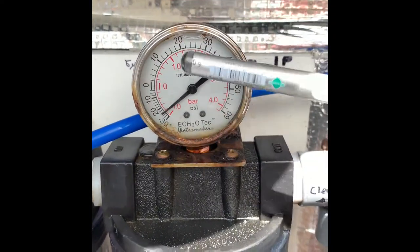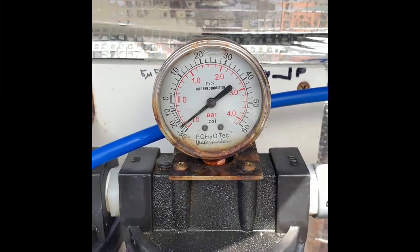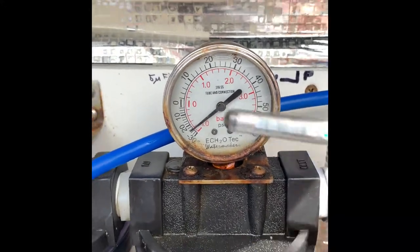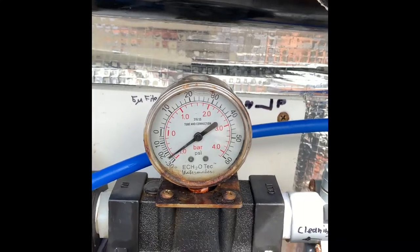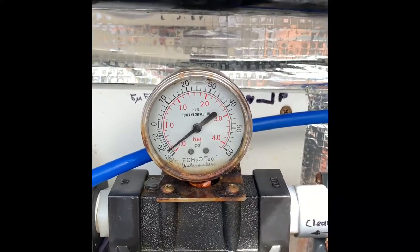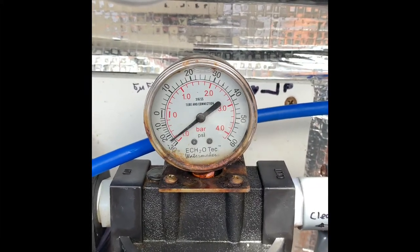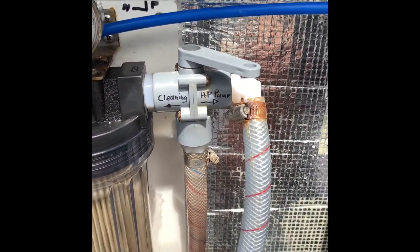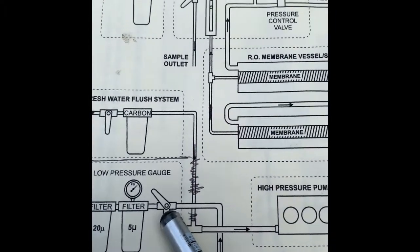It's a negative and positive pressure gauge. This indicates when the high pressure pump is sucking and the booster pump can't deliver because of blocked filters — it would go negative. If the booster pump delivers more than what the high pressure pump is using, it would be a bit in the positive range, which would be correct. Right next to it we have a changeover valve — that changeover valve is this one here.